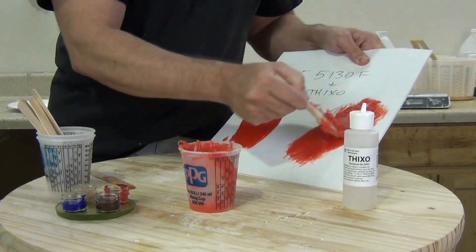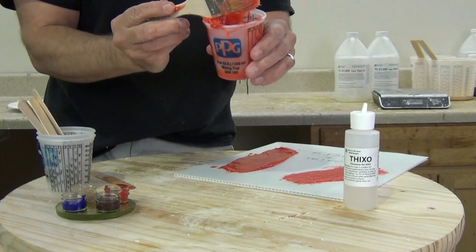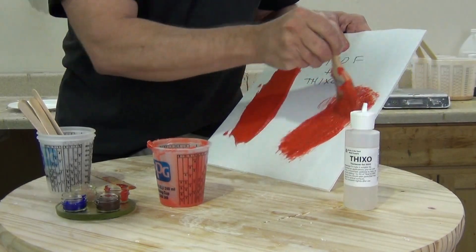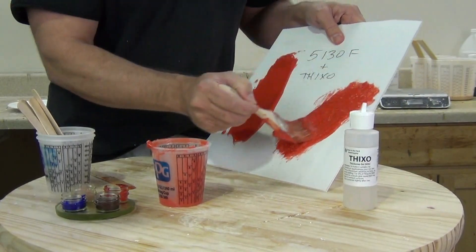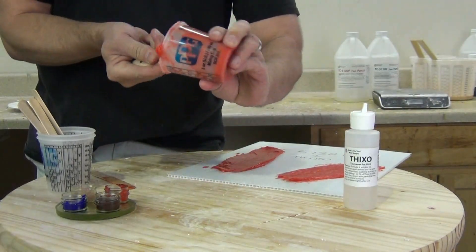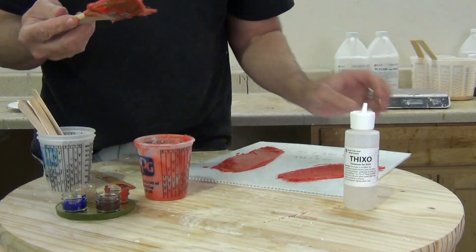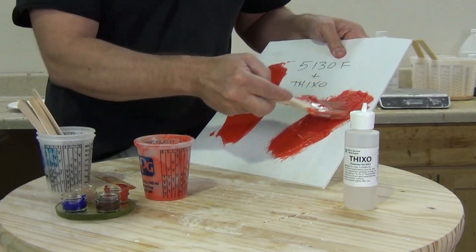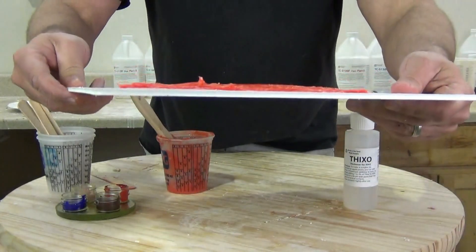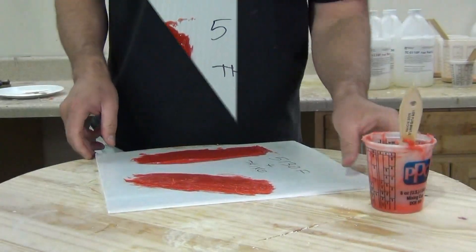Be sure to check out the video where we make a brushed-in skin using the 5110 thickened with Thixo additive. With that Thixo added, it reacts almost immediately and gets us a nice thixotropic paste — much like peanut butter — that you could easily brush onto a vertical surface. You can back off and put less in if you want it to be a little bit runny; it just depends on the application. This doesn't affect the working time, but you will notice the working time more when you add the Thixo, because now you're going to be brushing and manipulating the silicone with a trowel or a brush right up until it starts to gel.